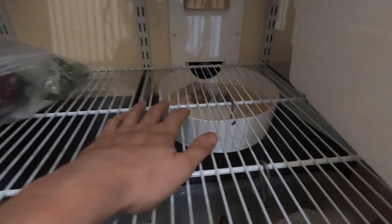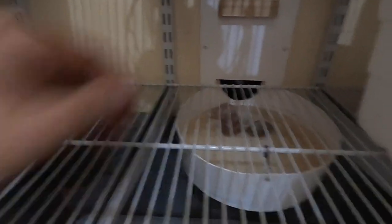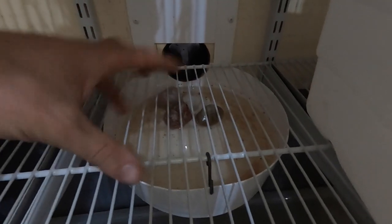The other thing I added — and I wasn't sure if I'd need it — is a little humidifier. That's salt water in there; I don't want mold growing so I dump a pile of salt in and keep it topped up. It's so dry in our climate that we need this — you might not depending on where you are. It's placed right next to the slide gate with rocks added to increase surface area. As cold air flows across, water wicks up and the air picks up moisture, raising the humidity.